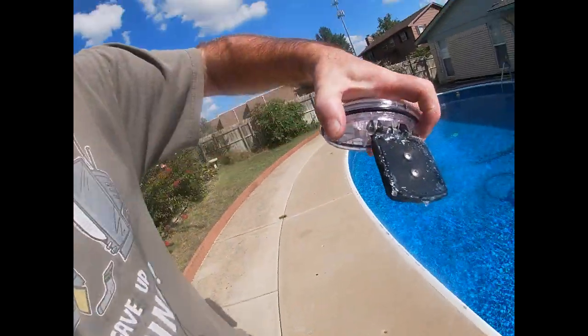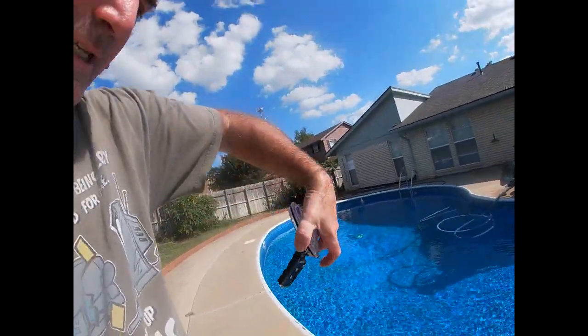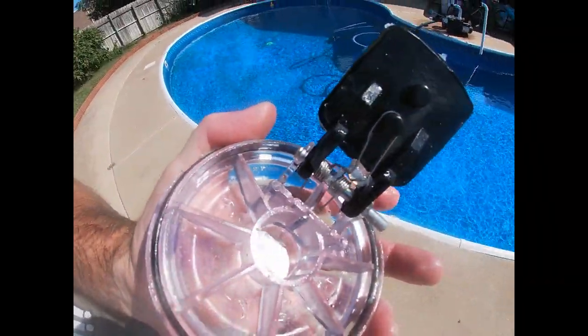The pump would not open up the valve in the check box. The spring — I tested it on a scale and pushing down it took three pounds, and I think that's too much. So I modified the spring, just pushed it down, and now it's got maybe half a pound if that. We'll give it a go.